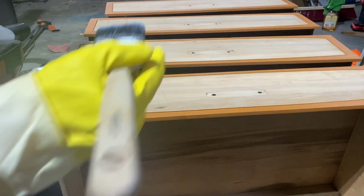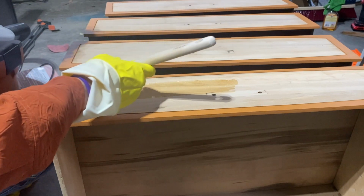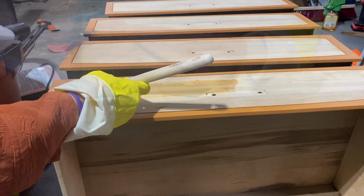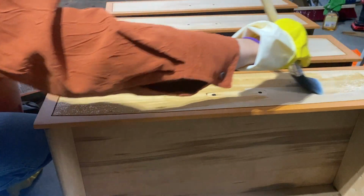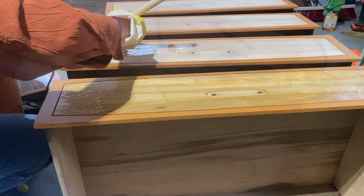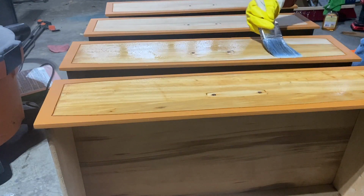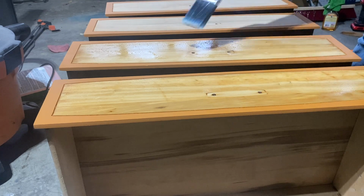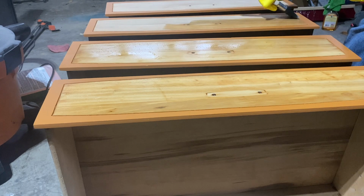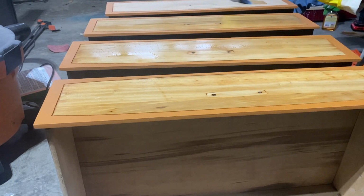Anyways, so you are going to brush it on to the wood, and this is a wood bleacher, so any kind of stain that your wood may have, I highly recommend oxalic acid, and then it just gives it a light kind of, not whitewashed effect, but just makes it a little bit more neutral colored once it dries. And also once it dries, you want to make sure to wipe off all of the wood with a wet rag that is with just water. Just, yeah, plain old water, just wiping it down, getting all that oxalic acid off.